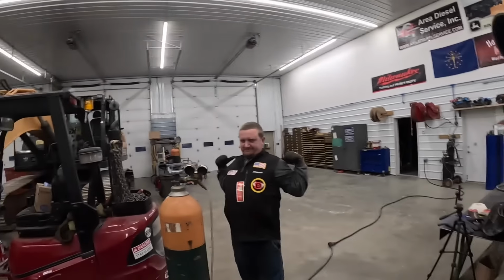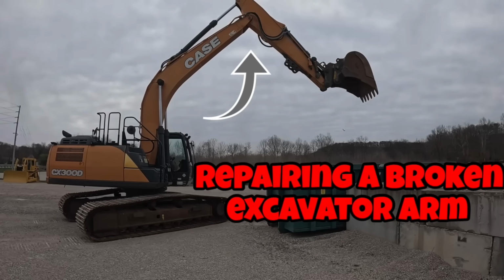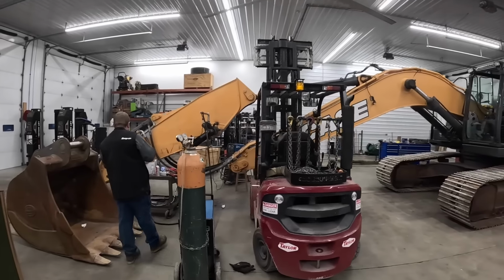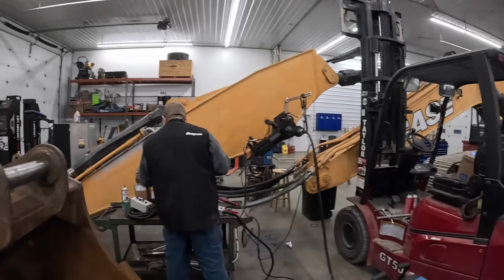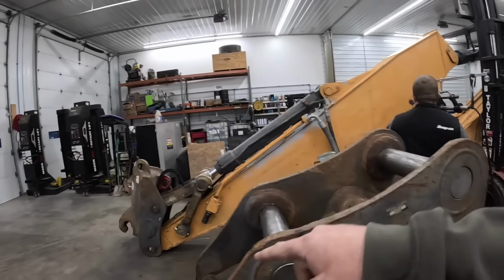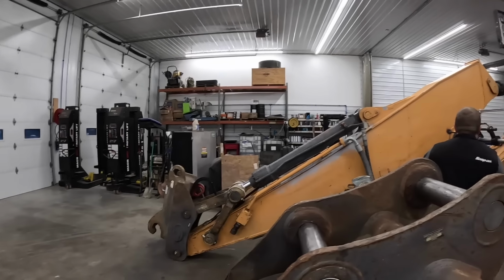All right, welcome back to CNC Equipment's YouTube channel. We are back on the Case 300 excavator. There's a previous video on it, and this is part two. We've got a 300D here. We had some sloppy issues with it. It's only got about 5,000 hours on it, but we had some play in the quick coupler. In the previous video, we actually spun these pins so we can reuse them again. You can go back and watch that. Tucker's got to do a little bit of welding yet on that.